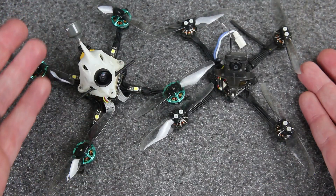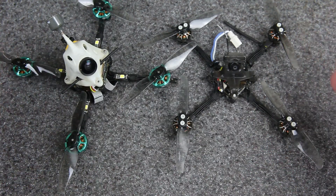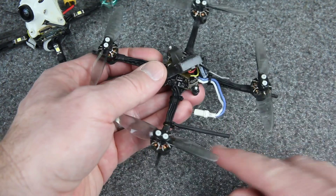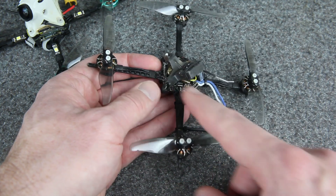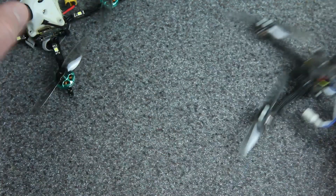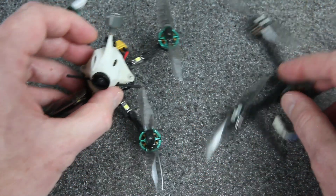The main reason I'm making this video is because I want you to be empowered — to know that you can be creative, to think about mounting components in the way that is best for your build. Don't feel like you have to be locked into any particular way. To show you that, here are several different builds. This is basically a 1S baby tooth with Flywoo motors and the Crazy Bee F4 Lite flight controller. I took off the motor plugs and flipped it 180 degrees of roll so the USB points up and doesn't hit the frame. But this one has the DJI Caddx Vista right above it, so an upward USB would be no good — I've got the USB pointing down on that one.